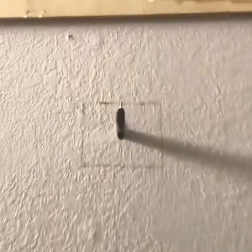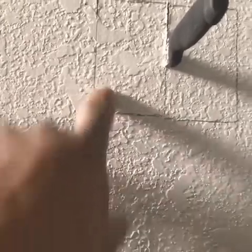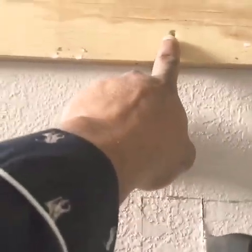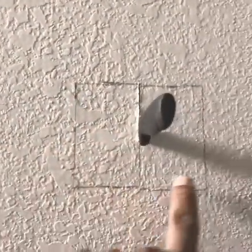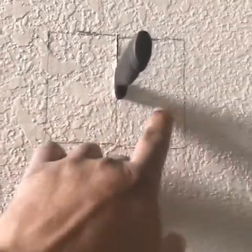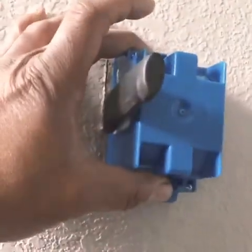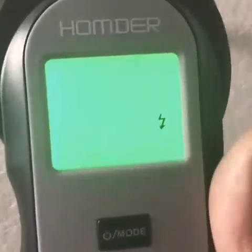Here's a quick look — I got the knife stuck in the wall. I drew my line on one side at first and realized that's right where the stud is, with my bolts lined up on it. As I started cutting I was hitting stud, so I drew my box directly on the left side of it. I'm going to use just a regular house knife and cut out the size of my box — all I did was set my box up against the wall, draw a line around it, nothing special. Before I started cutting I used my stud finder, which also has a setting for electrical.